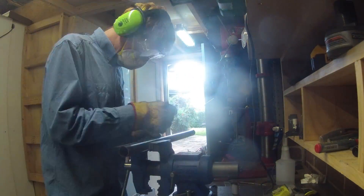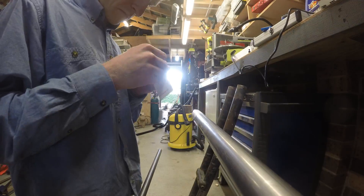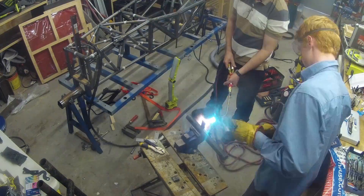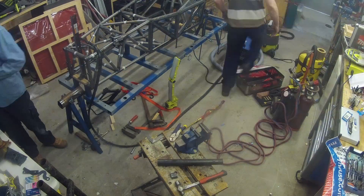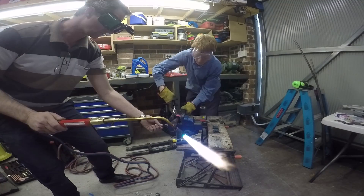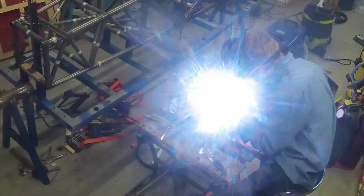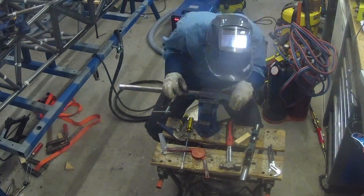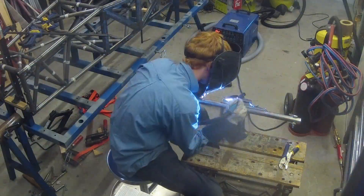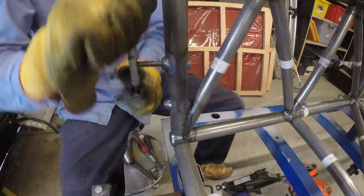These were made from a combination of plate and tube. To make the round supports for the H-beam we bent thicker 3mm steel using an oxytorch and a hammer. First we bent it into a slightly smaller radius then we hammered it into shape on the H-beam itself. After the mount was complete I quickly capped the ends of the chassis and tapped the holes into the chassis itself for the H-beam mounting bolts.